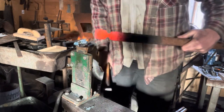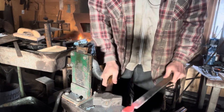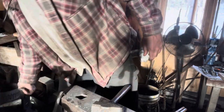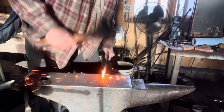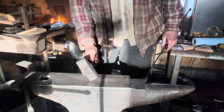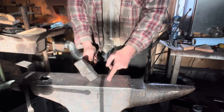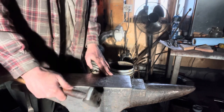We get it back to about this point here and we can knock the corners off. Then we'll go back in for another heat and start to draw that out — that's it for the guillotine tool. You'll notice I'm tipping my hammer at that angle in order to draw material out in this direction — it works in both directions — so I'm drawing the hook longer towards the camera.